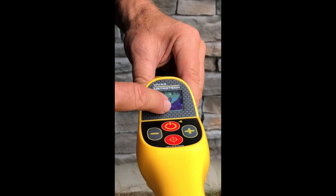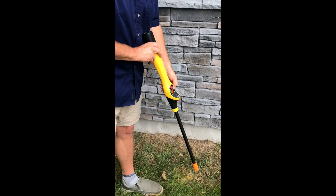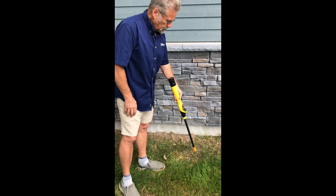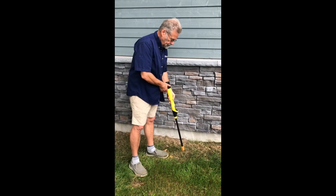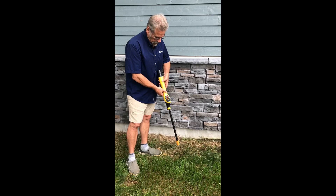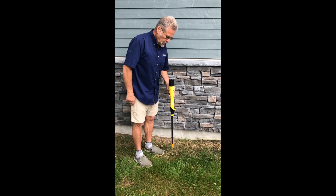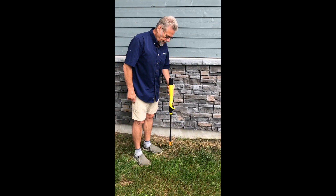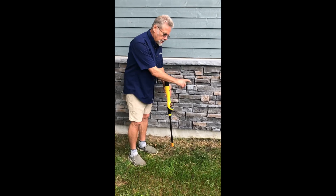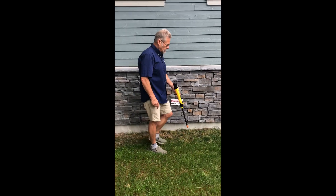Now you can hear the signal. I can see by the signal bar that I'm right off screen, so I'm going to take my receiver and move down to where the line actually is. Adjust my gain down once and let it go to work. This is the motion — you sweep back and forth when you're right on top of the conductor. There's also a secondary volume control: just place your thumb over that speaker. You get your locate, you can hear where it is, and by rotating the receiver, if you're not properly in line the signal will go quiet. The highest sound takes me in the direction of the conductor.